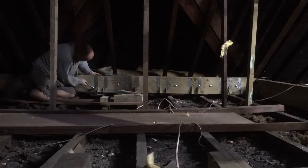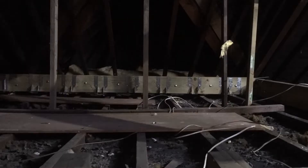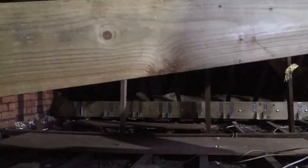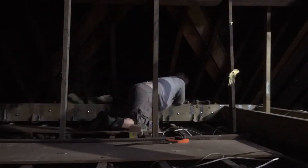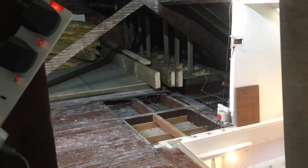This is the other side of the loft space — same process. I've built a big beam, I'm putting all the noggins in, and now I'm going to start laying the beams in again. I'm standing on bits of old wardrobe because it spreads the load on the old ceiling joists. In it goes — lots of bending over and crawling about. The bolts you can see are tying two beams together to make a structural pair.